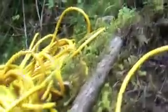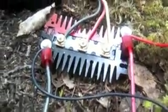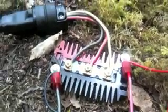The alternator is hooked up through this cable. It puts out AC, or alternating current, through this cable — this is a standard extension cable. On the other end I have a plug that comes into this unit, which is called a rectifier. The rectifier takes the AC and converts it into DC electricity. Hooked up to that rectifier I have my multimeter. I'm going to switch it on here and measure up to 200 volts DC.